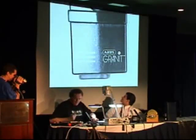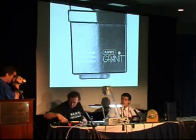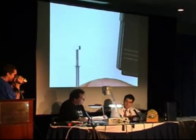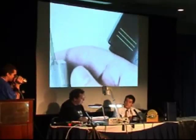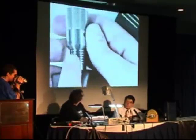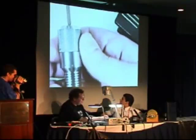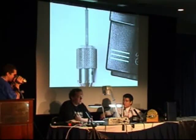In Germany, from my German lockpick friends, I bought this tool, which is now gone. Nobody leave. And it's this tool. It's called the Fall tool, because Mr. Fall made it. And it's a decoder pick. It picks the lock, but it also reads the lock. So you can make the key. Here you can see what pin you are picking. And here you can see the depth of the key. And yeah, with this tool you can open the lock that they claimed on their website could not be picked. It was a real challenge for us to pick it.